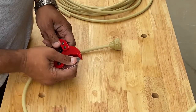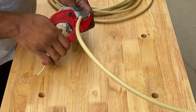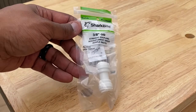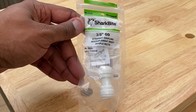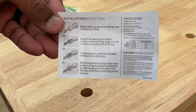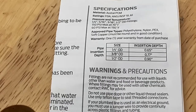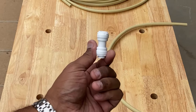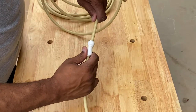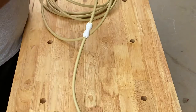With the end of the misting tube in hand I took the PVC pipe cutter and sliced off the end of the tubing that had the faucet attachment — we'll use that again later. According to the SharkBite manual, for 3/8 tubing you need to allow just under an inch of hose on each side for a strong connection. I grabbed one of the couplers, inserted the misting system end into one side, then grabbed the end of the 20-foot extension and plugged it into the other. The compression ends held the tubing together creating a seamless joint.